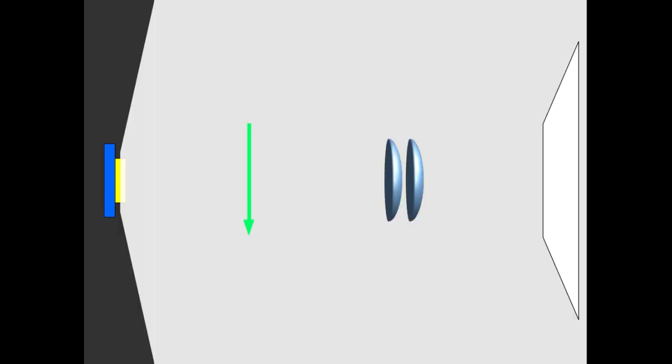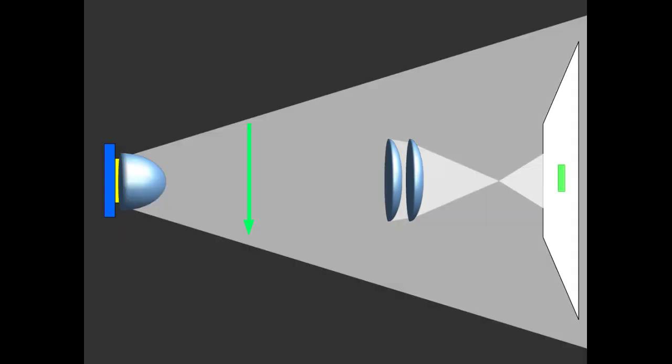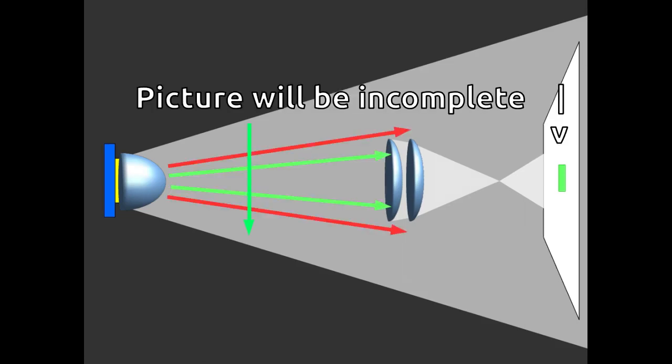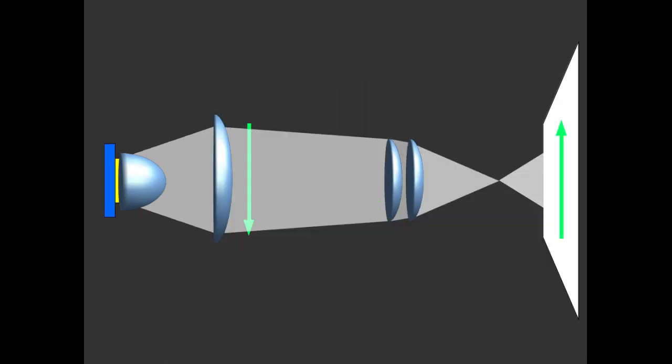The light. A projection light cannot just be a lamp behind the display because the light must reach the optics from every point of that display. Typical projectors have a single point light source with a condenser lens that directs the light towards the display. This alone is not enough because light that hits the edges of the display cannot reach the optics. Another condenser is needed to achieve roughly parallel light beams through the display.